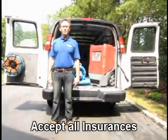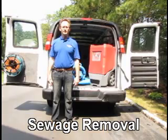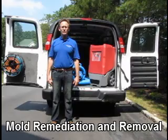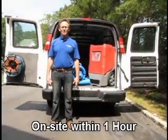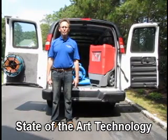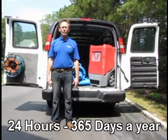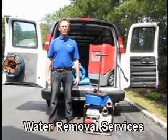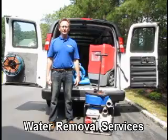There are 4 general principles of water removal. The first step is extraction, or the physical removal of the water. Removing the water directly in its physical state is 500 times more efficient than any other method of water removal. There are a variety of specialty tools that we use to extract the water.